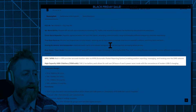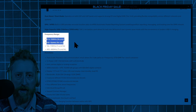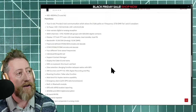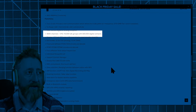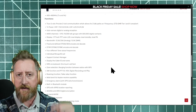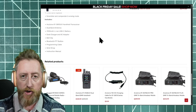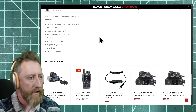It has GPS built in so it'll do APRS, and it has a larger battery — about 3,100 milliamp hours. It will receive beyond the 2-meter and 70-centimeter space, but primarily it is a 2-meter and 70-centimeter band radio for transmit and receive. It'll accept 4,000 channels, 10,000 talk groups, and 500,000 digital contacts. It also has USB-C charging as well as a desk charger.